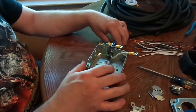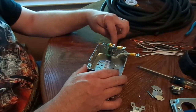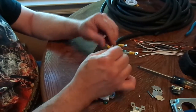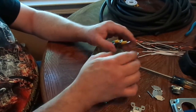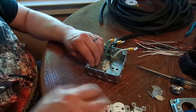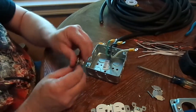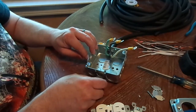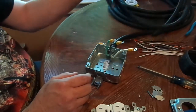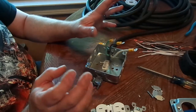What I've done so far is I've ran the SO cable into one side here into the knockout. I pulled the connectors back, crimped them, and soldered them. So this side is ready to go. Now we just need to run the SO on the other side — put it in place, cut the SO cable, strip it back, put the ends on, and it'll be ready to assemble.